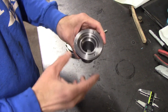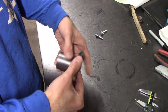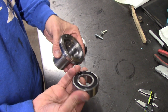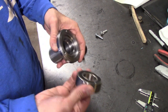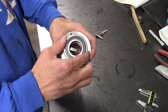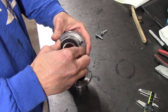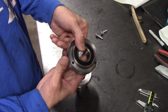So here's the idea. Here's the completed part that goes on the oil pan side, and the cross tube goes in here, and then this is the bearing I'm going to use, which is basically a bearing meant for some kind of Kia, but it's meant for a jack shaft application, and I made it just a slight, a couple thou clearance fit on this side, but then on this side, it's not a press, but it's really close. One of those things, you gotta get it just lined up perfect. And the shaft will be pressed into the ID of this.